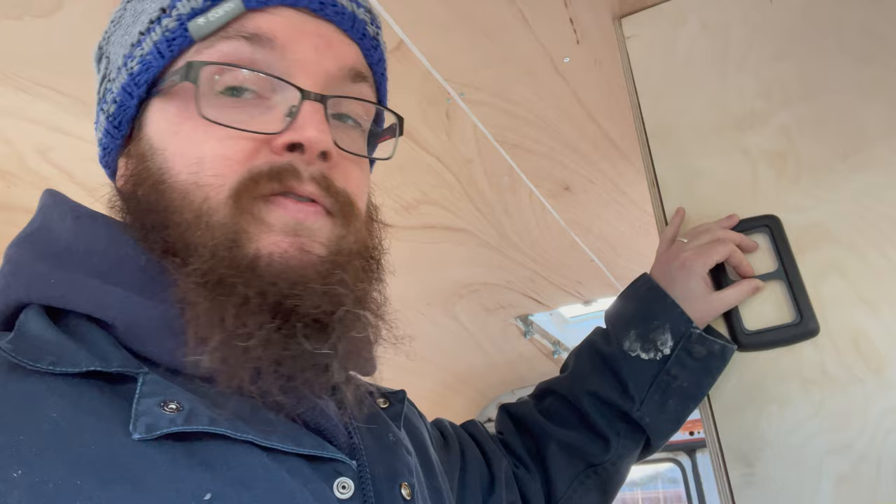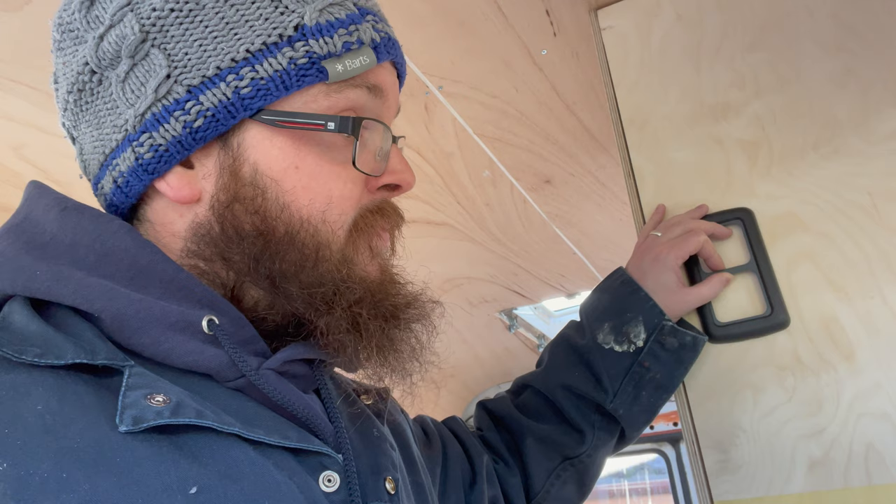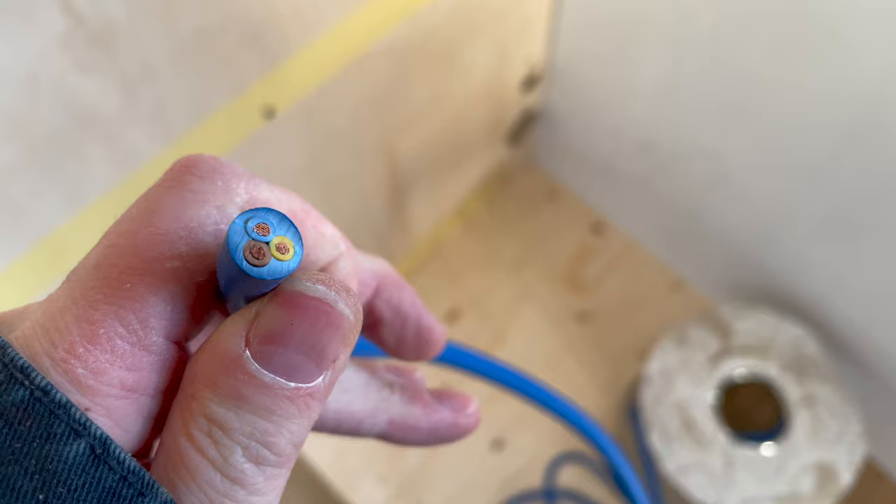So they're going to be switchable here and as we enter the bus at the front, so we can switch those off and on at either end of the bus. Everywhere else we're keeping it fairly simple so we don't have to run lots of cable, but for this one I need to run a three-core wire from where this switch is down to where the other switch will be. The first thing I need to do is decide which way round to put them. Kelly and I have had a look and we think it makes sense to put them this way round — it looks better with the switches in and gives us a bit more room over here to hang stuff. These are fitted in exactly the same way as before: masking up and marking the centre points for where you're going to drill through, a 51 to 54 millimetre hole, then mark up where the screw holes are going to go, pilot hole through if needed, and then it's mounted and you're ready to do the wiring.